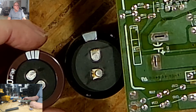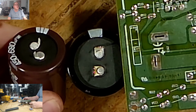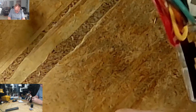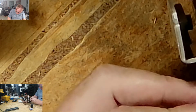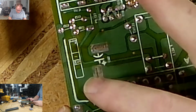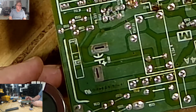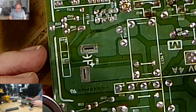And this is not. I mean, I'm here and here. See? So whatever way I try to put this in, okay, because I remember I did one of these before and I just left it because I did not want to drill it. The answer is because you have a lot of ground plane here. You see all this ground plane you have. You can technically drill the positions for this to go in, and still be on that ground plane, and you can still clean. You can scrape some of the solder mask off, and you have a soldering point.